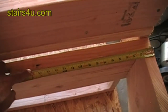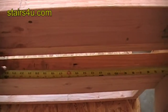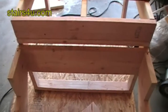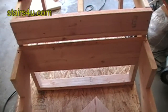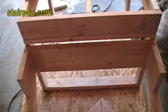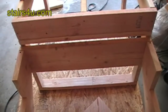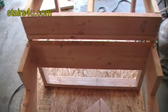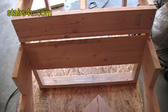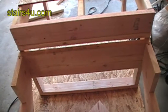Where we want to be 16 inches normally. So again, check with your plywood — some three-quarter inch plywood spans 24 inches for your floors, so three-quarter inch plywood for the stairway might work. But I do want to point something out: some building codes and some building departments require larger materials for your stair treads, so check with them to make sure they accept what you have before you build it. The last thing you want to do is build the stairway and then have them make you tear it down — and trust me, sometimes stuff like that happens.